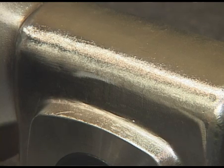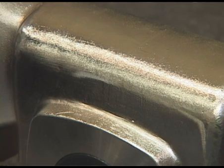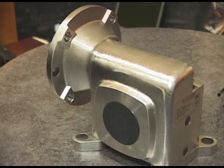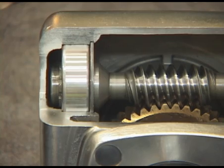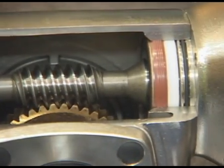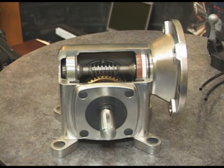The biggest feature is the rounded housing of the speed reducer, and that helps to withstand any pooling of fluids and any potential bacterial growth on the top of the speed reducer. Other things to help with the pooling of fluids include recessed screws, caps over the screws, and a two-piece base that enables maintenance people to caustic wash-down or spray right under the reducer so particles can go right underneath.